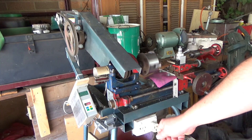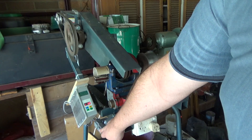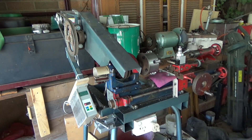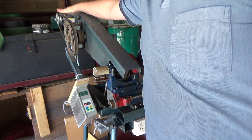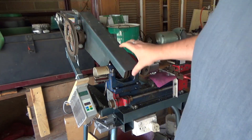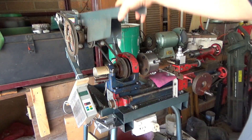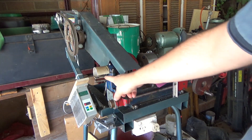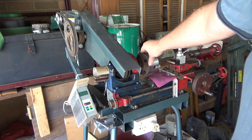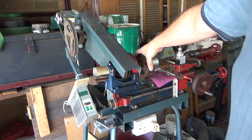As you can see, we can turn the lathe on to go quite slow, or quite fast. I currently only have this speed controller set to 2000 RPM. The motor itself can do up to 4500 RPM. There's a reduction happening in the pulleys here, but I still feel like at full speed this lathe is running faster than it really should. At some point I'd like to get a tachometer so I can measure the speeds, because I think this lathe was rated for up to about 1000 RPM, but I have no reference for that.